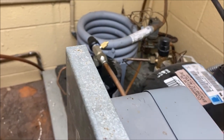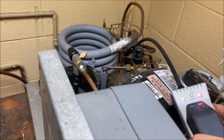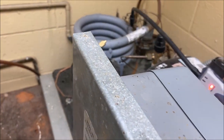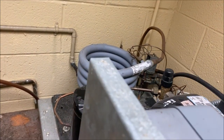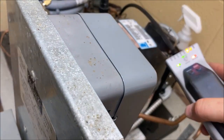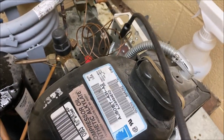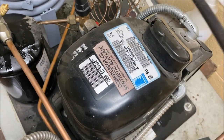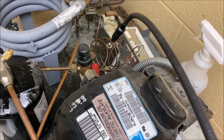I don't really see any signs of oil, so let's take our time. That's our water-cooled condenser — we're going to check all our usual suspects: the flare fittings going into the pressure switch. Taking our time here and — bang — getting a hit right here in the area of this pressure switch. It looks like it's these little capillary lines on the pressure switch that are definitely leaking. We had a rub-out on this capillary tube on the pressure switch.